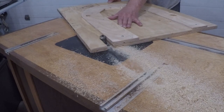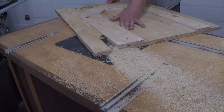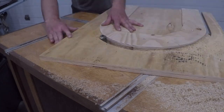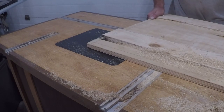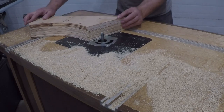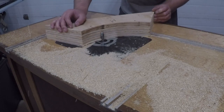To create the offset for the outer clamping blocks, I used a router bit that was close to the same diameter as the thickness the arch is going to be. I cut the outer ring into segments, then glued and screwed layers of plywood to build up to the thickness I needed, and then routed them to shape with a pattern bit at the router table.